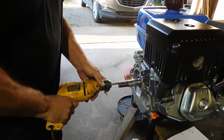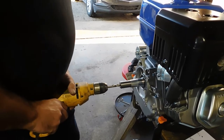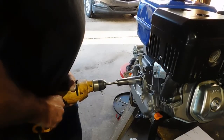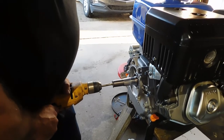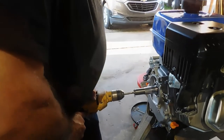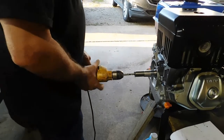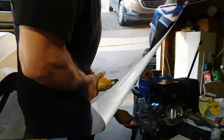I've got to get it back to about right there. I've already done some drilling. The deeper I get, the more I've got to pull the drill back out to let the chips come out. It takes a while. I'm almost there, but I've got to tap it.